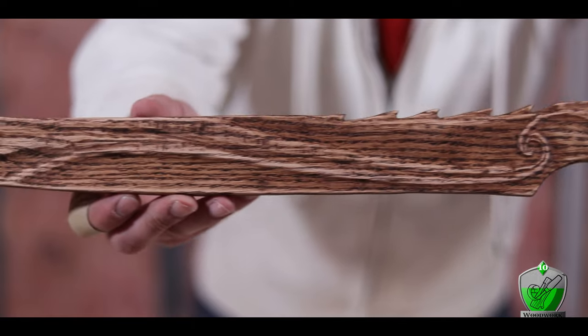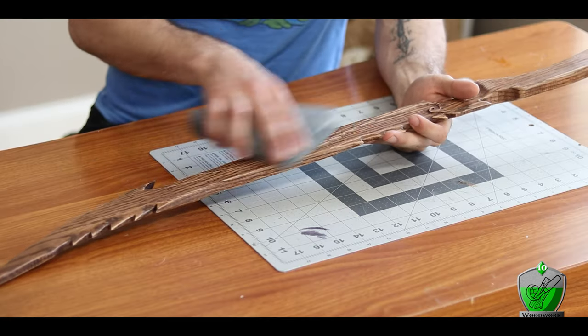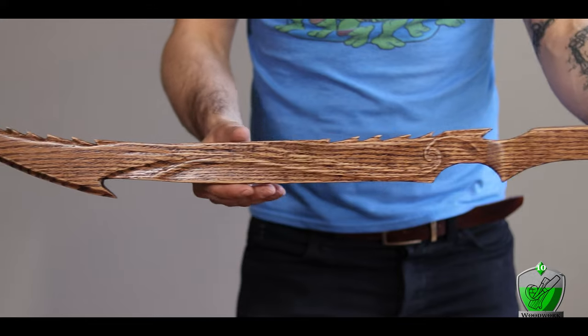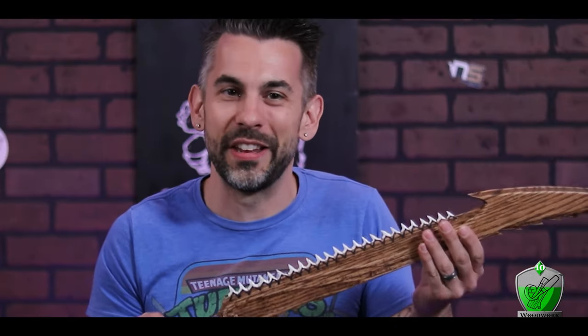I like that story better than 'I went to Home Depot and got some shark's teeth from Etsy.' That is canon now — ghost ship plank, killed shark, used teeth. The sanding trick totally worked and added a lot of depth to the whole piece. I then sprayed on a semi-gloss poly to protect it and add a little shine — three coats total, sanding smooth with 800-grit sandpaper between each coat. The semi-gloss brings out all those high points again without making it look too shiny or plasticky. It looks quality.